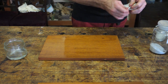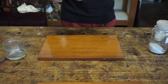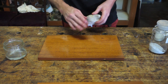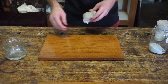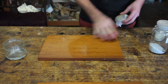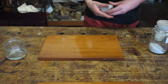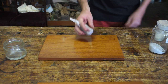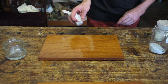We're at stage two now, which is the next stage after the grinding or filling stage. Now that I've filled all the pores with a mixture of pumice and shellac, I want to build a body on top of the timber, which gives you the depth in the finish. This is where I start to use a little bit of oil. The oil isn't actually a constituent as such — it's more an aid. It just lubricates the surface, because at this stage the top of the board is completely flat, and you get quite a lot of friction between the face of the rubber and the surface of the timber, and the oil just helps it slide.